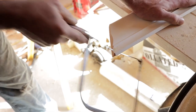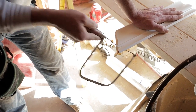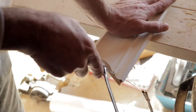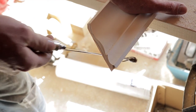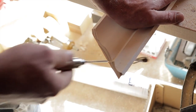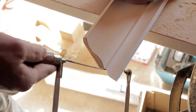Stay along that line — the difference between the paint and the new cut — and constantly think about back-cutting. When you're at the top you're going this way, and further down you're going more underneath. You don't have to go start to finish — work with the material, follow the paint line, and get rid of that material. We'll just continue and finish this whole thing.